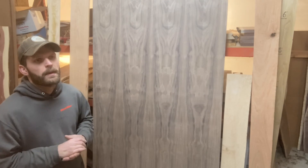And then you have your solid MDF core where they just stick hardwood veneer on the outside of a big sheet of MDF. MDF is very stable — it's just one big sheet — and it works great in paint applications, but it's not quite as nice as a veneer core or combi core. The MDF core is also going to be quite a bit heavier than a veneer core or even a combi core.